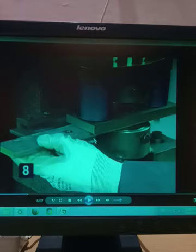Up till this moment, there should be low pressure. The operation can be done on low pressure and it should be fast. So for fast, you have to give more amount of fuel, hydraulic oil. When I supply more hydraulic oil, the motion will be faster, right, with less pressure. But at this moment when the punch has touched the workpiece, now see what happens.